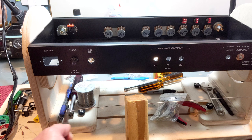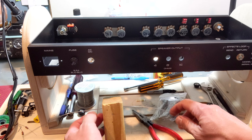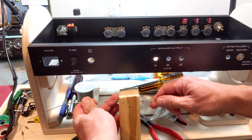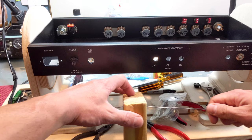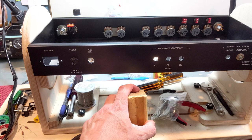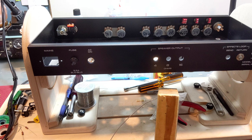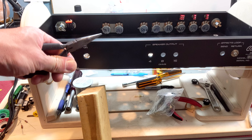Then I go back and forth pretty hard, and I'll even bend it down — that works the kinks out. I go in all directions, just back and forth. Even a simple pass through the two-by-four already straightens it out pretty good. It's best to use the pliers; it's hard to demonstrate on camera. Eventually you run it through and you'll get a wire — it may be curly at first but then you straighten it a little bit and there are no kinks. Pro tip.